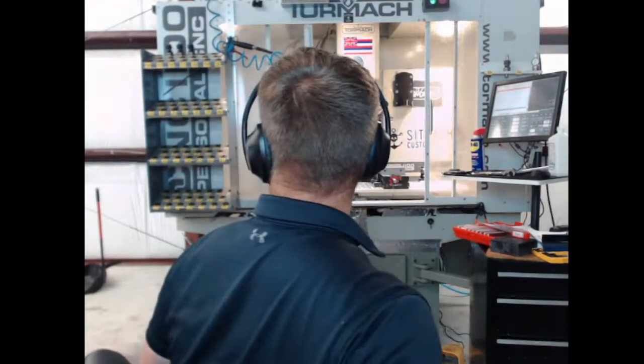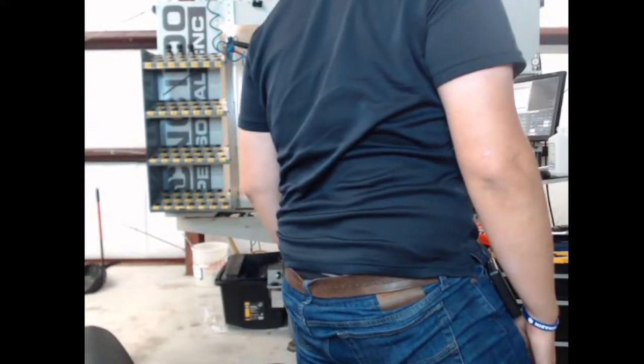We're in setup to number 1 and 2. You know what? I don't like that though, because it's actually tool numbers for me. I just want to renumber this one to 3, just for my brain to not mess that up, even though I'm sure it would be very obvious if I was putting an end mill in there instead of the chamfer tool. 3, let's simulate the whole thing.